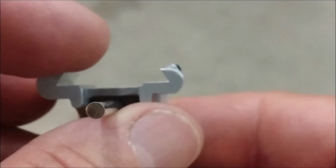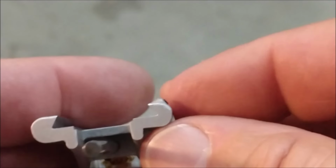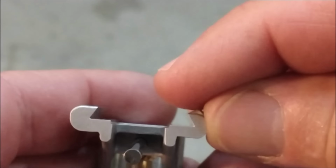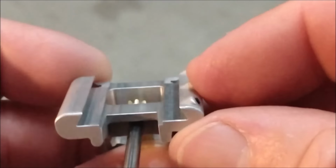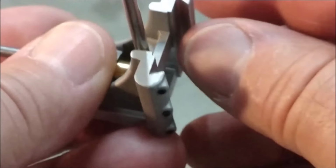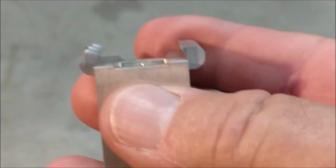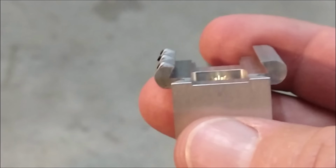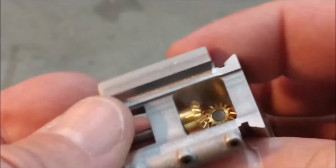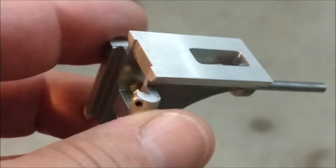protrusions on this side for the knee screws, they are forcing you to bank on the angle and the inside face. So the depth of the feature that I'm cutting right now has to go deeper to allow for it to clear back here. And the sides do have to be shaved down somewhat to allow for these protrusions. That is a shame. I wish it was something a little different than that, but that's the reality of this situation. So I'll cut that dovetail at 126, 127 deep, and I will fit this. And that's just the way it's got to be. That's a shame. I wish it was more like a real knee mill, but I guess that's the way it was back in the 1800s. Okay, so be it.